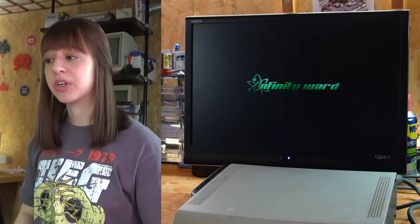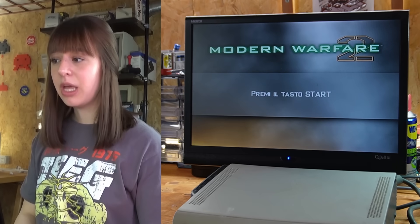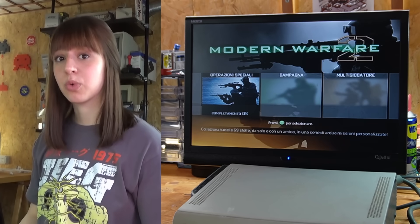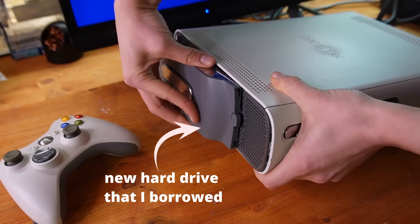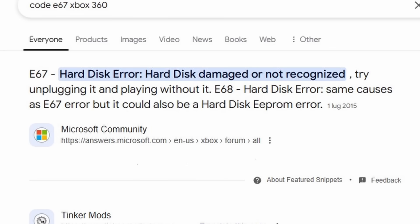The game is working perfectly, so there's nothing to worry about on that front. But I don't think I have a spare hard drive to check if the issue is related to the Xbox itself. I'm still happy I managed to get the Xbox working — maybe if I find another hard drive I can see if there's more work to do. It's been three days and I managed to borrow a hard drive to finally test the Xbox — I replaced it and luckily it worked. I also tested the old hard drive multiple times and it kept showing error 67, which is most likely related to the hard drive itself, so I would rule out other issues with the Xbox. As always, thank you for watching — let me know in the comments what you think, don't forget to subscribe to my channel and my Patreon page, and see you in the next video, bye!